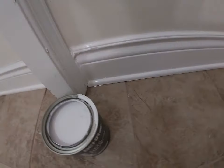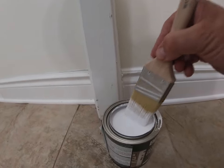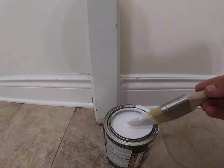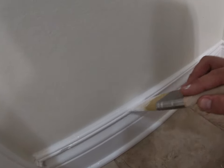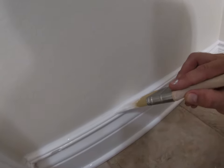Just to reiterate — I'll clean that little drip. This is the way I do it: dip the brush, clean this side, maybe clean the end, leave it on the top. You don't want to get right to the wall right away — at least I don't — because there's usually going to be a bit too much paint there. Then just get it close.